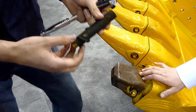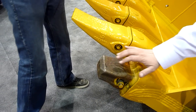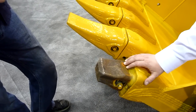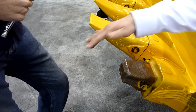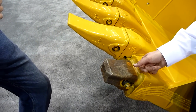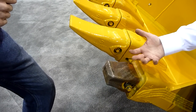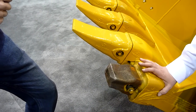The adapter nose design has nearly parallel, lots of flat surfaces for absorbing load. We've got good torsional load absorption as well as impact load absorption. The adapter nose design is symmetrical also, so that if you're in an application where it makes sense to flip teeth, you're able to do that as well.